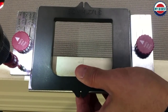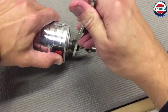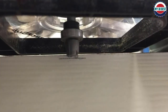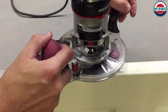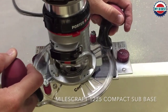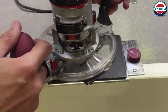The main frame is hard-wearing steel and templates are ABS plastic, which is also quite tough. Setting up the jig isn't as quick and easy as some, but high accuracy is achievable once in place. The relevant template is held with the supplied pins. A tungsten carbide router bit is included, though it has a half-inch shank, meaning the Milescraft door hinge jig can't be used with quarter-inch routers unless a different cutter is purchased.